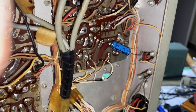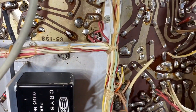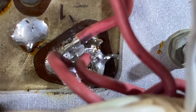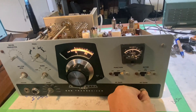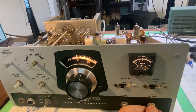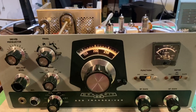Here's the problem: I checked all the resistors I installed and looked at this one — see where it's shorting to ground? Let's clean that up. I should have caught that before, but I'm going to fire it up again. And this time I want to see that meter peg out. Beautiful. And as it comes down, we should start to get some sound in the speaker — and we do.